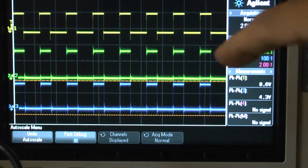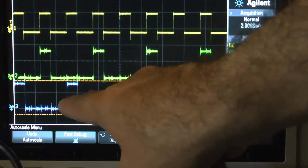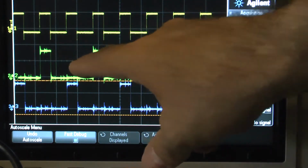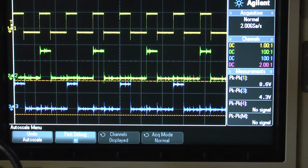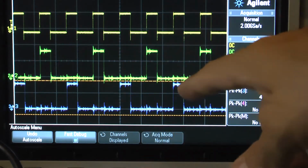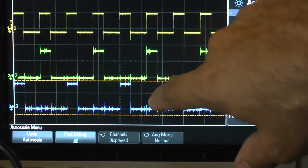One of the problems you see here when we take the frequency, let me show it again. For each cycle, only one side of the channel is actually initiated. That means every second cycle the same channel gets a signal, and the same for the other side. What does that mean? Let's say you have a single chip IGBT and your tuning frequency is 100 kilohertz. If you use this kind of technology, you would have to use 200 kilohertz to adjust for that in order to provide a 100 kilohertz signal. Also, another problem: you see the large gaps here in between. That's when nothing happens, so you need to compensate for that.